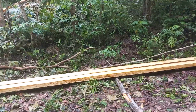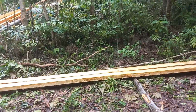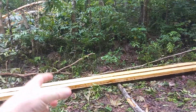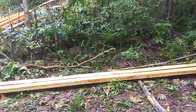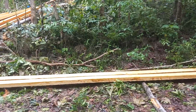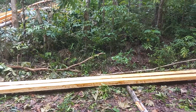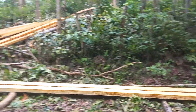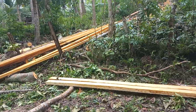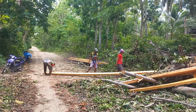Well, don't worry too much, because when it flips on its side, that becomes twice the thickness, because it's 6x3 or 3x6, and that twanging about will stop straight away, because the value of the stiffness will go up 8-fold. So it's 2 cubed, since you've doubled the thickness. There, look at that. See that bouncing about like crazy.